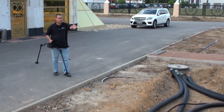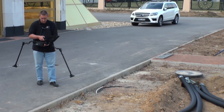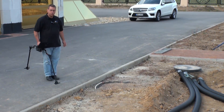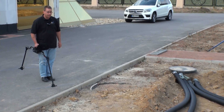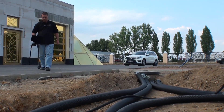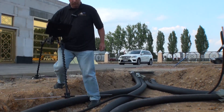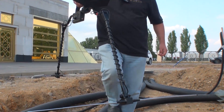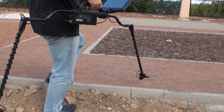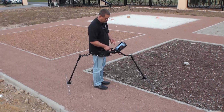I'm going to do a short scan of this area. We have a freshly buried water tank here. To start the scan, I'm going to push the multi-function button one time — the light will blink. I'm going to hold the unit comfortably in my hand. It is blinking; I look at my screen and I have the signal coming in. I'm going to hold this as steady as possible over the object. When I'm done with my scan, I will push the button and the scan will stop.